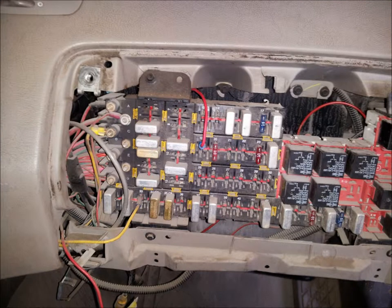Access the power distribution panel located inside the passenger side of the cabin dashboard. Route the red wire through the firewall adjacent to the lower air conditioning condenser line located below the passenger side dashboard. Route the red power wire down and along the passenger side frame rail following the existing wire harness.